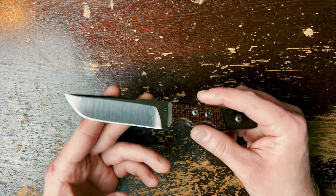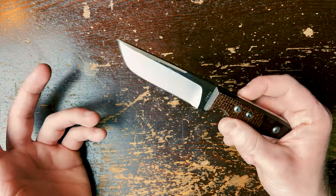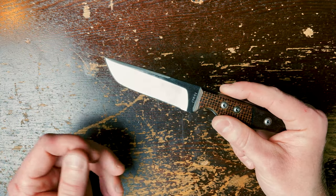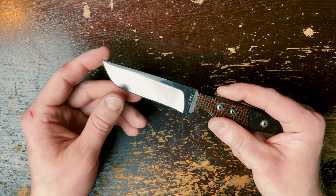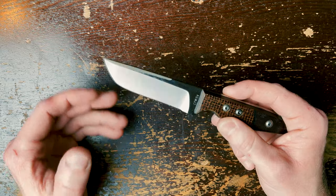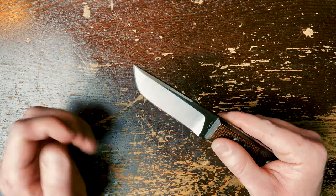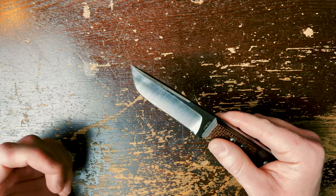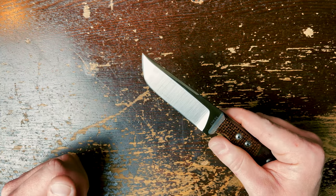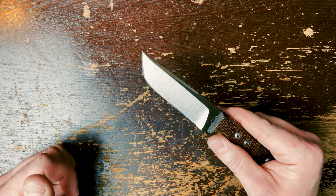Yet for all the thickness, this tip is remarkably pointy and can be used to pierce things, aluminum paint cans, some wood, whatever, and you're not going to deform or break the tip. That's virtually impossible unless you're doing something super dumb. The false edge grinds really help that point. I think there are 5 surfaces kind of coming together at the tip, making it a lot finer than is visually apparent. But the angles are shallow enough that they give the point a lot of strength.